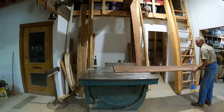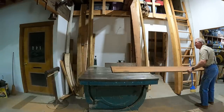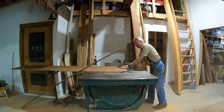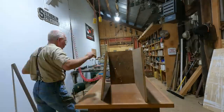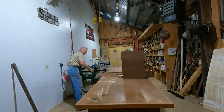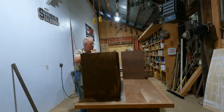I'm starting the process by ripping some three-quarter inch form plywood that I have on hand. This is a very nice flat solid plywood product with a paper face on both sides that stands up to repeated concrete pours really well. I feel pretty lucky to be able to build these boxes inside a wood shop instead of where concrete forms are usually built — outside, in the dirt.